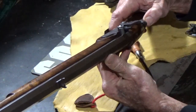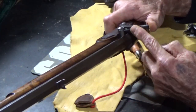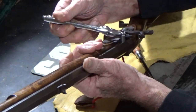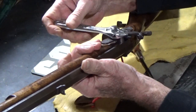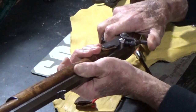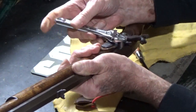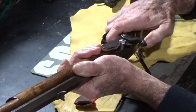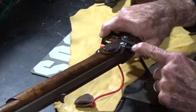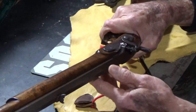If you can see that on the camera — you can see that it is just falling a little bit too far away. So what you want to do is take your wrench — this is an adjustable metric wrench by the way — and tighten that just a little bit more. This is what I call timing it; it's not really what it is, but you could call it that. That hammer falls down over the top of that nipple and allows it to fire the percussion cap, so it's a pretty simple thing to do.